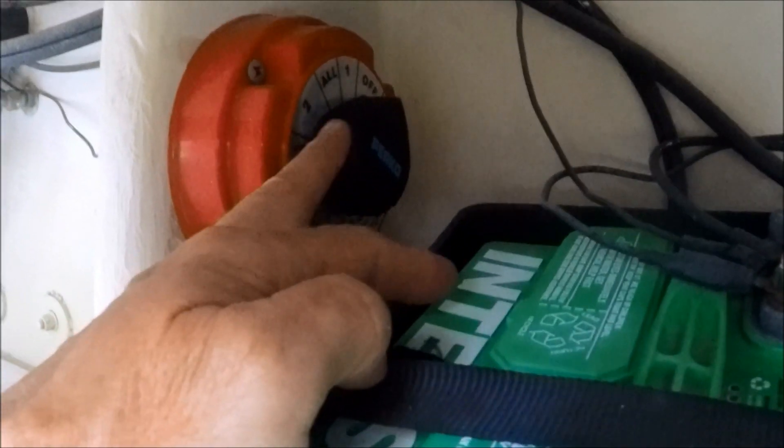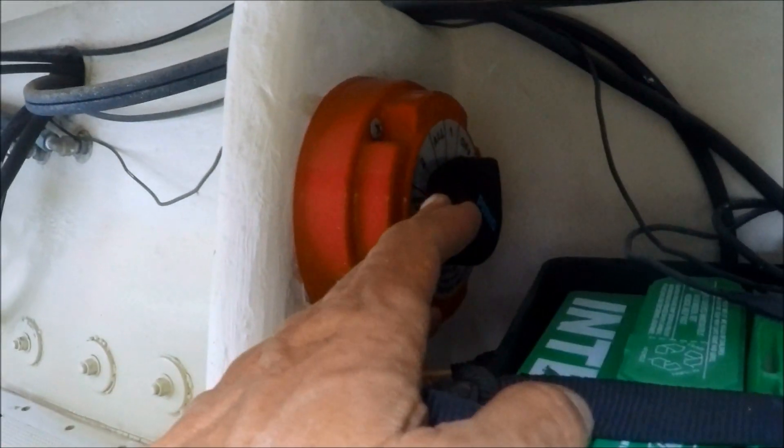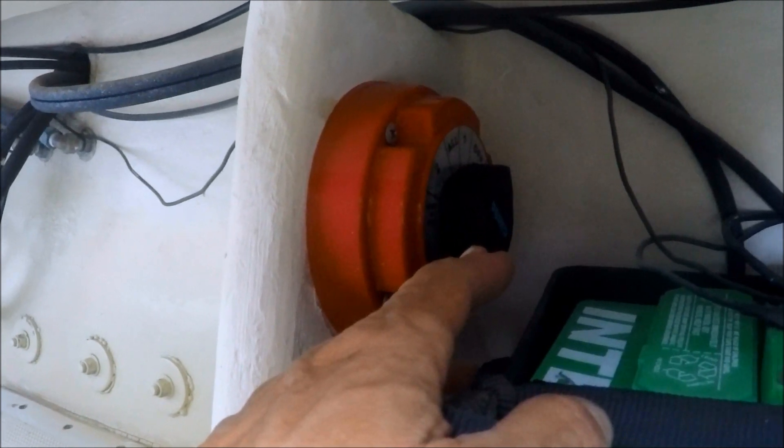What we've got to do here is disconnect the fittings, then loosen the screws for the bracket so it comes out. I've got to unplug the old unit, and I have a ground wire that runs underneath the stern all the way to the batteries. Before you start any project like this, always turn off the power, which I have done — I've turned all power to the off switch. I've got dual switches for dual batteries, and my negative will hook up on the negative side. I've got everything turned off and will start disassembling. Let's get to it.